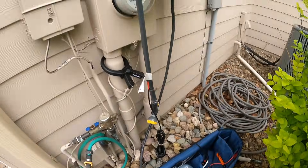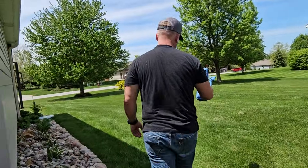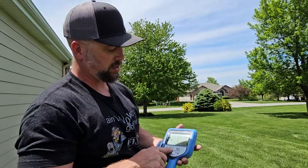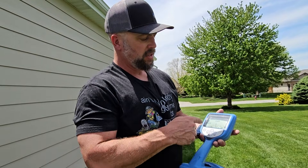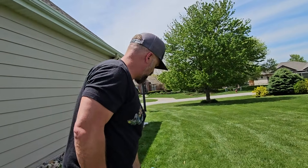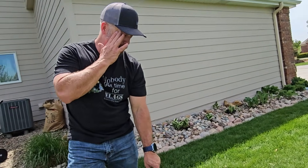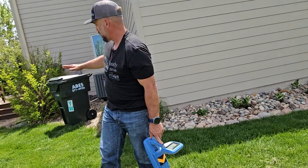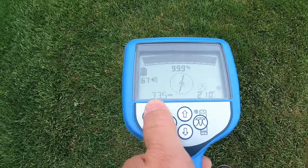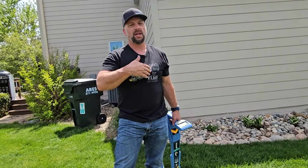Get out with the receiver, turn it on, match your frequency to 33 kHz. I was on 8 kHz from the direct hookup — as soon as I switch to 33 kHz, there's signal right there. I can measure milliamps close to where I hooked up: 33 milliamps — that'll be my benchmark going forward, making sure those milliamps stay nice and congruent as they slowly dissipate.